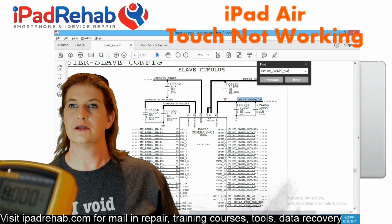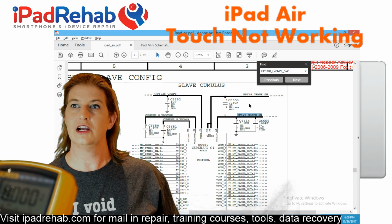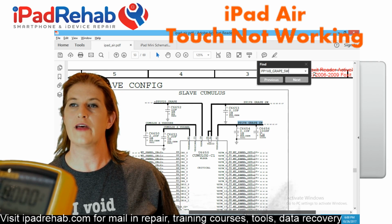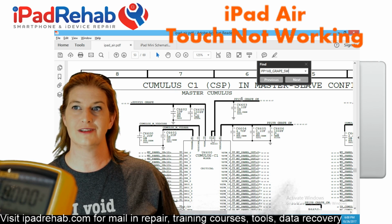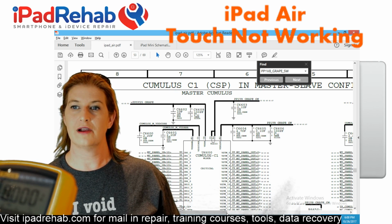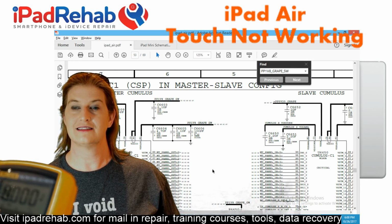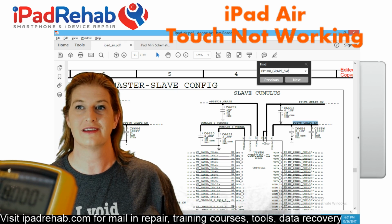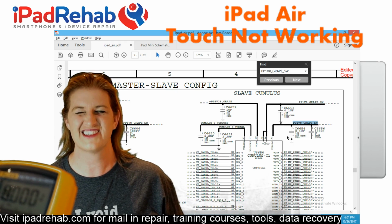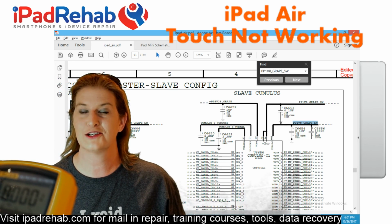So here we have PP1V8 Grape SW that is plugging in here, also here, and we know that rail is present because we just measured it. It also plugs in here at Master Cumulus, and it plugs in there. So our guess is that that line is now 1V8 at these touch chips. We could measure it again closer to the touch chips to make sure there's not any kind of problem, but probably it is absolutely there, because there's no real mechanism for how it could get an open line between this little source chip and the Cumuli.